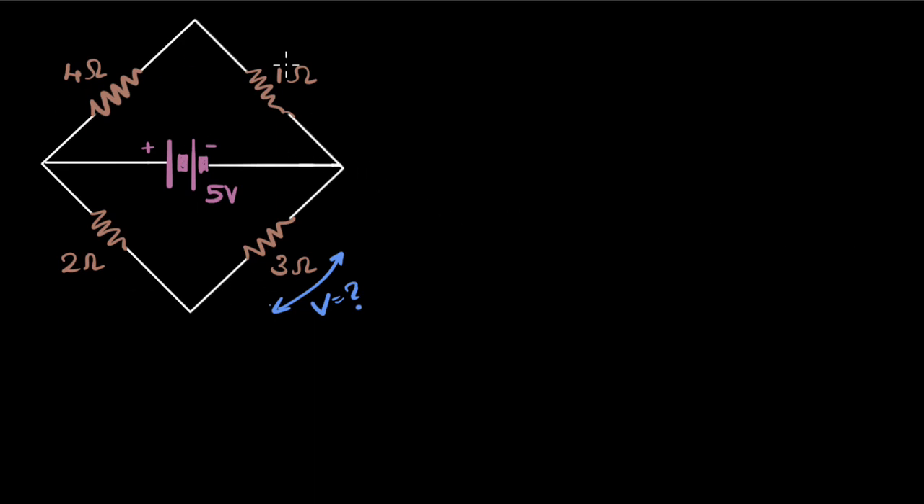Can we find a couple of resistors which are in series or in parallel? I see that this four and one ohm are in series with each other because whatever current goes here, all of that current comes here — same current means series. Similarly, I find these two resistors are in series. But these two resistors are not in series because whatever current comes here, not all the current necessarily goes here. Some of the current might go elsewhere, so there's branching — not in series.